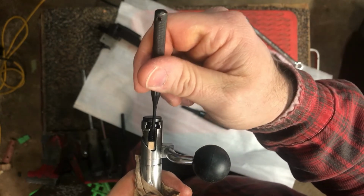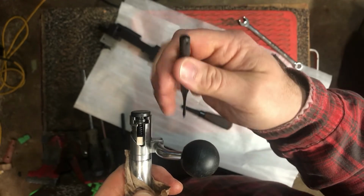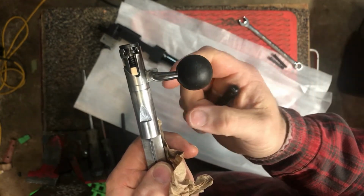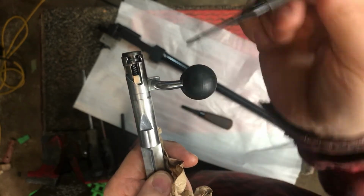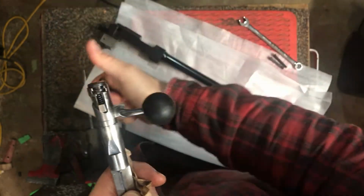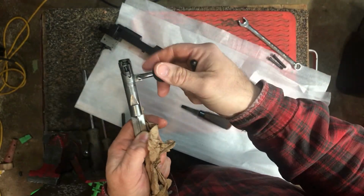Inside here is the firing pin spring, and there's a top hat on it. When you cock the bolt handle, you compress the spring, pull the trigger, and it flies forward and hits the hammer. The hammer inside that hits the firing pin is very similar to Schultz & Larsen, just a cylinder with a sear contact surface on the end. Almost identical. However, the Schultz & Larsen is a cock-on-close, where this is a cock-on-open. So when you lift the bolt, that's what cocks this rifle.